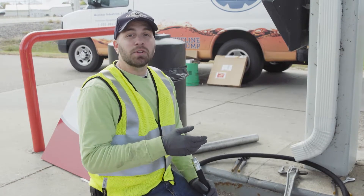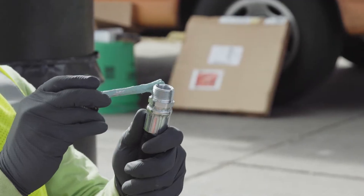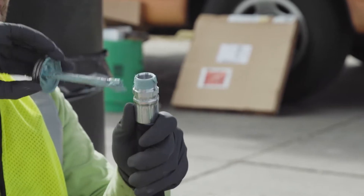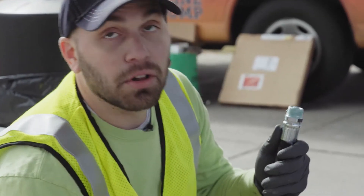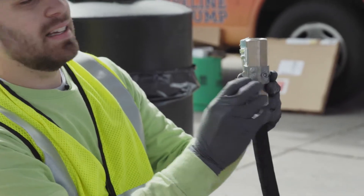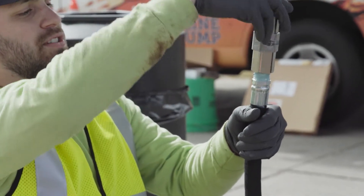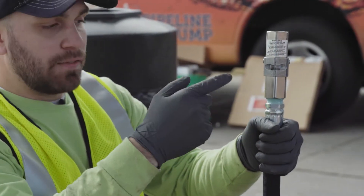Now that we've taken off the old hanging hardware, we have to put together the new hanging hardware. We're going to start from the top with the breakaway — just put a light coat of pipe dope on it, and this is what's going to hang off the whip hose. Both ends of the hose are identical, but when you put this on there is a correct way. You want to be able to read the 66V because that's where the flow comes from, so just make sure that you can read it up and down. We've got that loosely fitted on there.